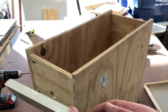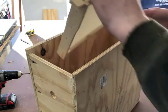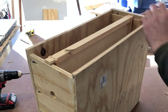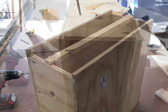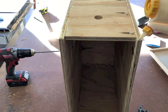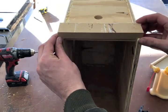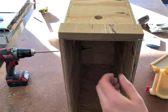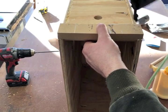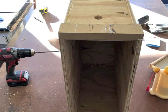The next step is to apply these frame rests right here. You're going to have your frame that's going to fit in here, and this is going to be on the outside, 5/8 of an inch down. We're going to start off with a little bit of wood glue, get that nice and flush with the top, and secure it down with some inch-and-a-quarter brad nails.